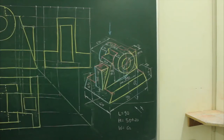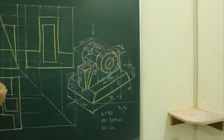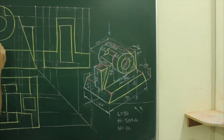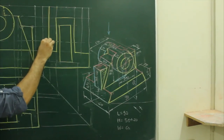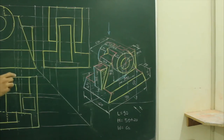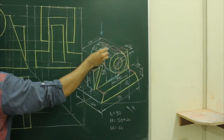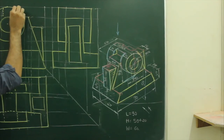So we got this part. After this, for the circular object, if you see the main diagram it is 44. So what we need to do from center is take 22 on each side, or project from the top view. You can project from the front view as well. After this, when you see from the side, this object is going up. This height is not mentioned, so what we need to do is project from the front view — where it is intersecting, from there it will project.